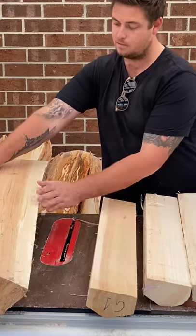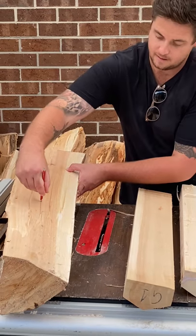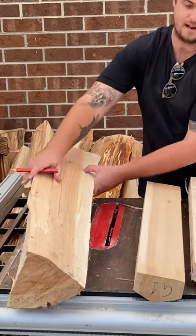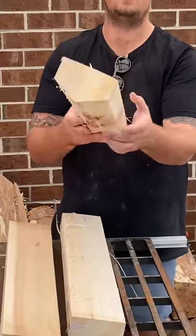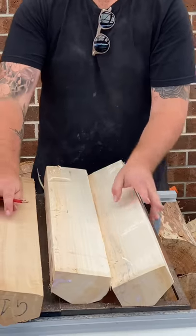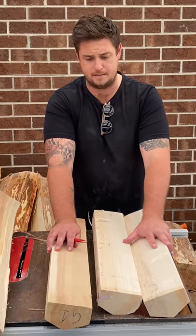We need to keep as much sapwood as possible, and this will be the face — you're cutting down a line through there which gives you the face of the bat. Then we process it into the cleft like this, and then that's going to sit for probably four months or more to dry out.